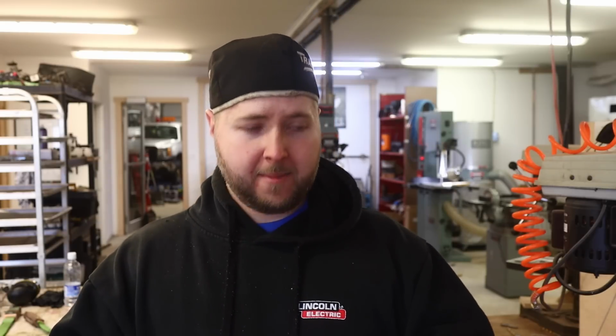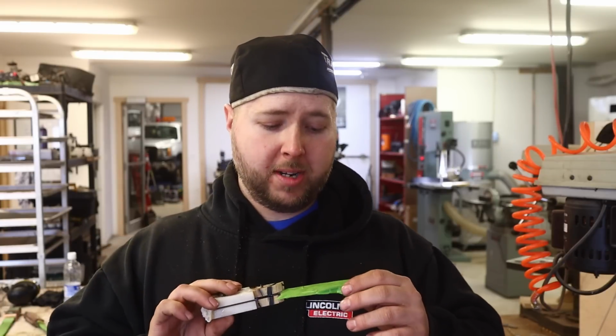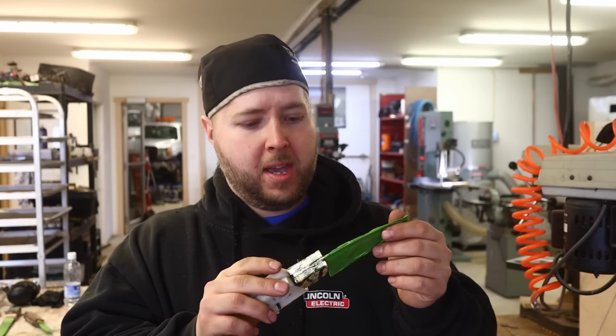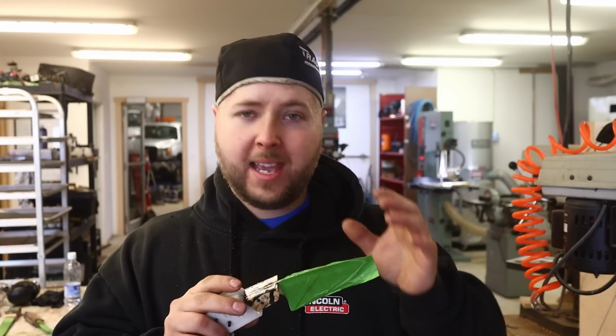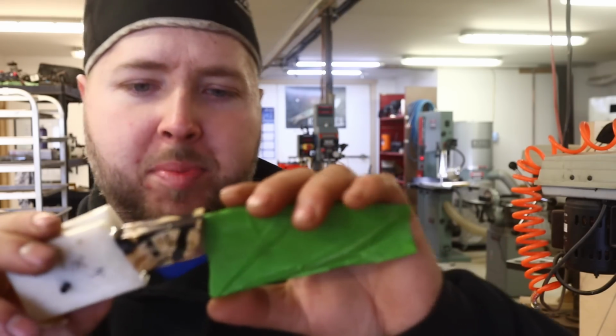Well, this week, I saw it there. I never had quite a full batch to go in for heat treat, so I said, you know what, I'm going to take another crack at that knife. I've got a brand new Scotch-Brite surface conditioning belt for the belt grinder, so I said, I think that would do what I want to do, which is make those lines flow nice and smooth. And so finally, I got it taken care of, and I got that shape on there just like I wanted in the fuller, which is beautiful.